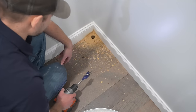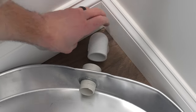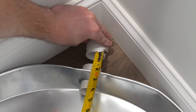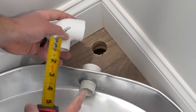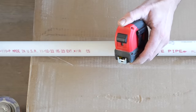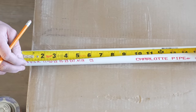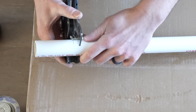The hole is drilled out — let's clean this up. I'm going to take an elbow to go down through the floor, place it in the center of that hole. The piece of pipe I need goes an inch into each fitting, so with about an inch of distance between them, I need a three-inch piece of pipe to reach the hole. Then I'll extend it down about a foot to get past the floor joist. I'm cutting those pieces from the one-inch pipe stock.